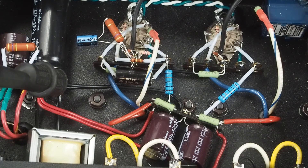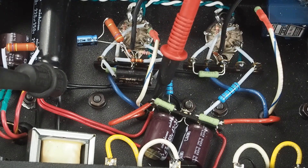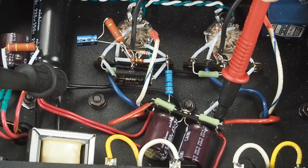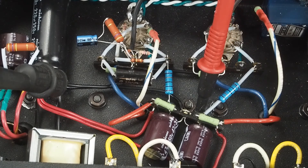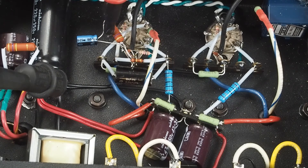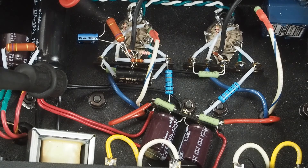The way you do this is you connect your ground wire up here. With no tubes and without any of this wiring — when I had just done the power supply — I was seeing right at 300 volts here and here. You'll see almost 300 volts here too because there's no load on the system yet. Once I get the tubes in and got this bias down to where I had about 15 volts measured here, this is the point where you'll measure the bias on the cathode of the output tube.